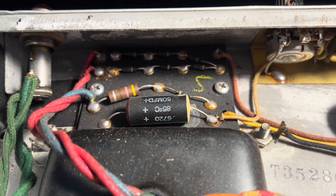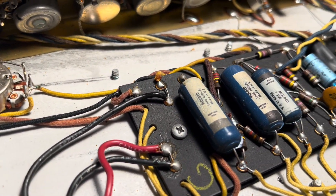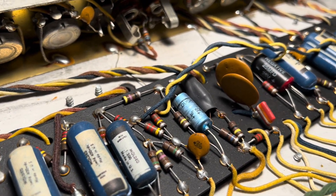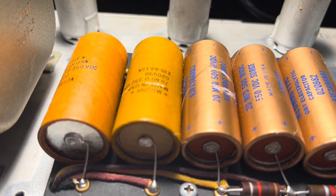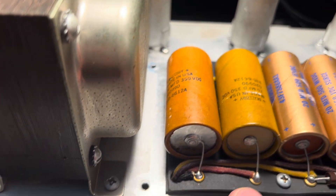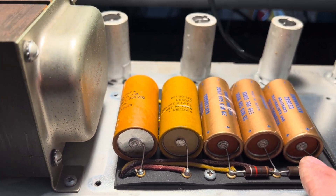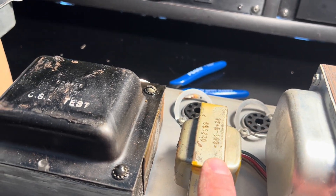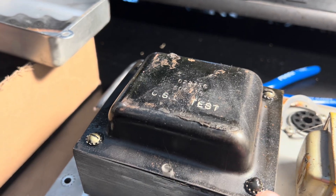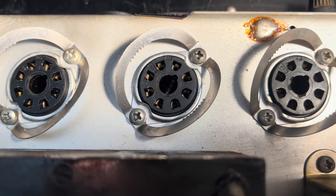This one I will change. Beautiful. And it's the same with the doghouse here — beautiful General Electric filter caps alongside the old Mallory's, but they all need to be changed. There's bulging on the anodes there. Your output transformer and choke are from '66; your power transformer is from '67. Pretty cool.